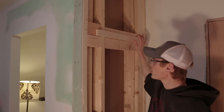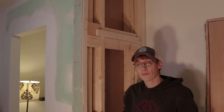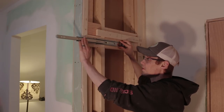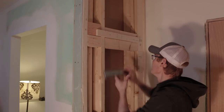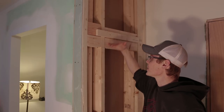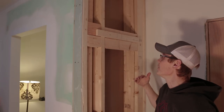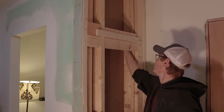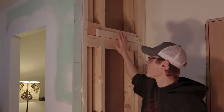To give you a rough idea on how you frame things out — I've got two 2x4s going across here at the top and two 2x4s down below. The main intent is to hold the weight of the mirror as it slides across on the door slides. When you hang a mirror on the wall, sometimes you don't realize what it looks like until you step back — a little low, a little high. Having two 2x4s gives you enough flexibility to make adjustments as needed, and it's a lot easier than trying to secure another 2x4 after the drywall is already attached.